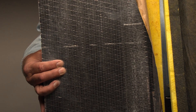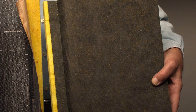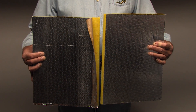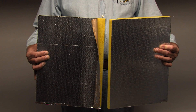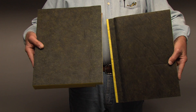This exterior surface also serves as the finish and provides the closure tab for duct joints. The other side of the board is the airstream surface. These surfaces are tough enough for air movement up to 5,000 feet per minute without breaking down, and stand up to duct cleaning if needed. Fiberglass duct systems come in three thicknesses: one inch, one and a half inch, and two inches.